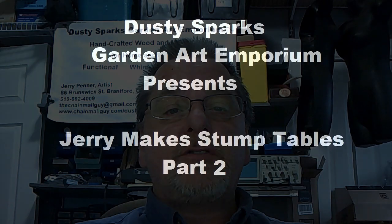Last time I showed you how to build an XY table for a wood router. I used this to mill my wood slab pieces so that I could make tables out of them. I sanded them, removed the bark, added some clear petroleum-based caulking to the cracks in the bottom so that the two-part epoxy won't run out when I do the top pour. Today I'm going to show you my method for adding two-part epoxy to a punky cracked wood slab.